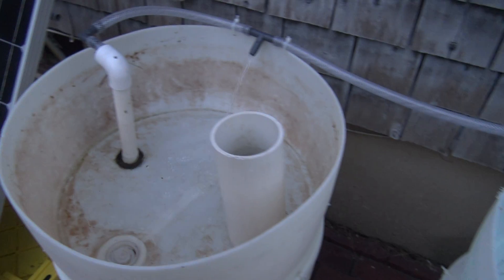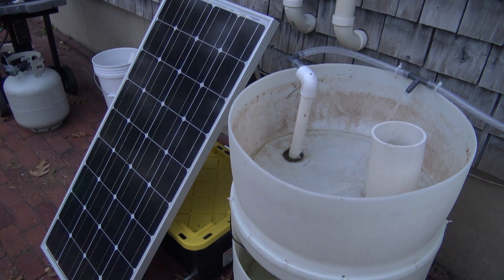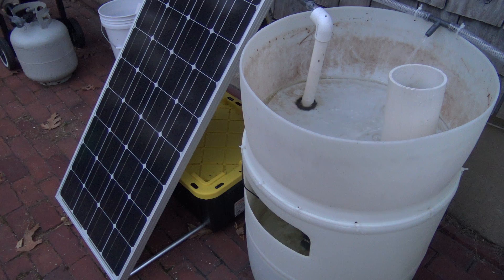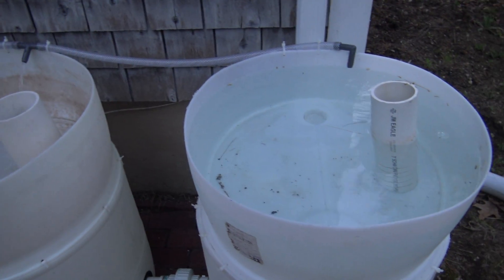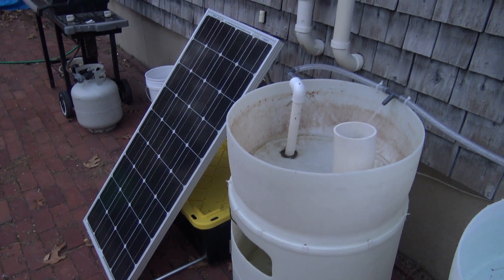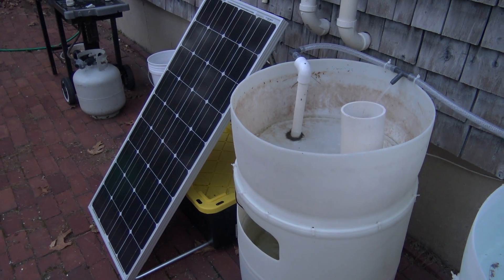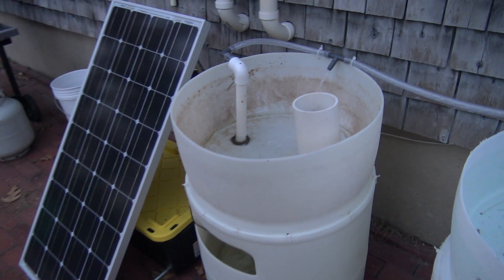I did mention that I wanted to run this on sunny days and cloudy days. It's been raining for the past two days, and after about 24 hours this pump did stop. I popped open the dry box and found that the battery was fairly low — obviously because it had been cloudy and rainy for two solid days. As soon as the sun came back out, I flipped the switch back on and the pump turned on. The solar controller doesn't allow the battery to go completely dead, and it was able to charge back up once the sun returned.